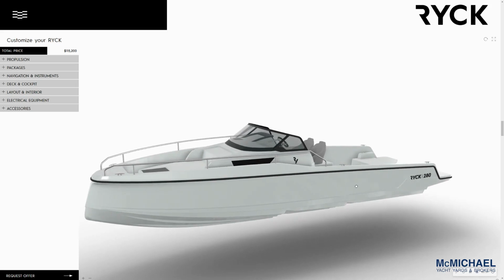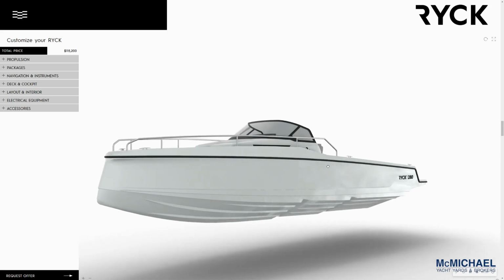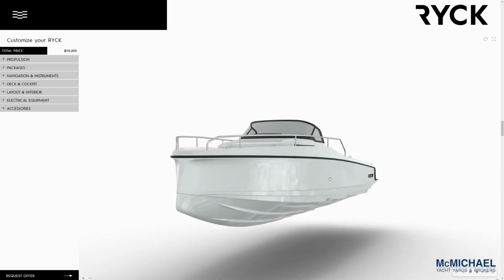So first and foremost, you'll notice that there is a very consistent shear line. It's just ever so slightly curved here. But then our freeboard, we have a reverse bluff bow. Our freeboard is consistent pretty much all the way aft, and there's a fair amount of that freeboard. And what that means is on the inside, we're going to have a higher gunwale, a little more safety, but more importantly, it's part of the overall hull design.